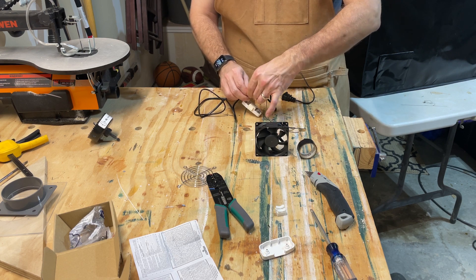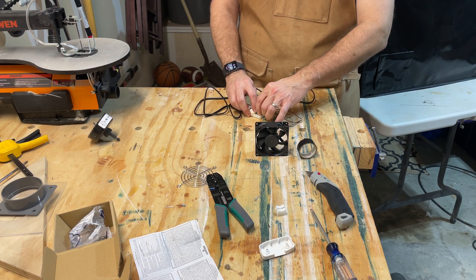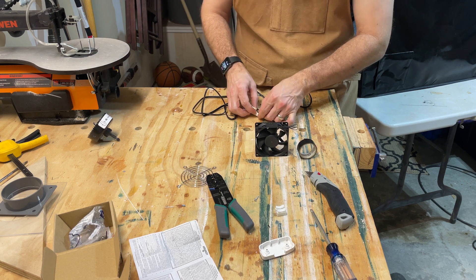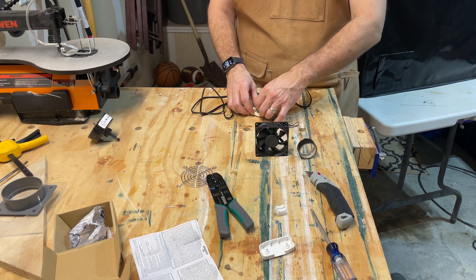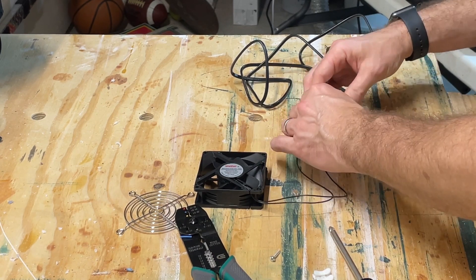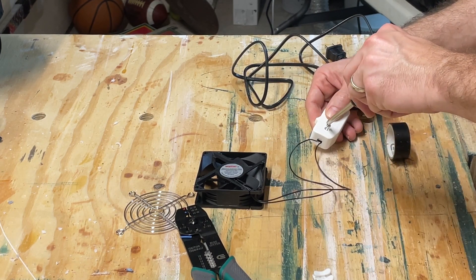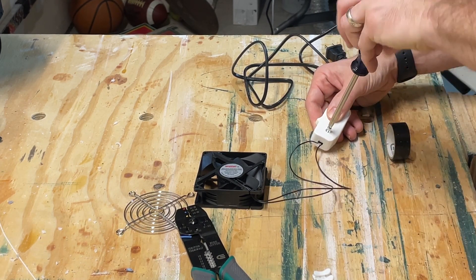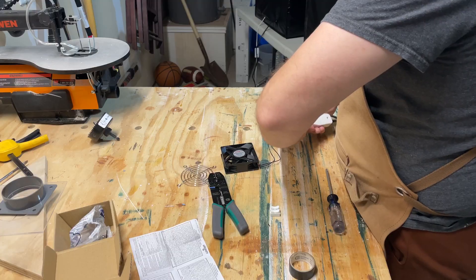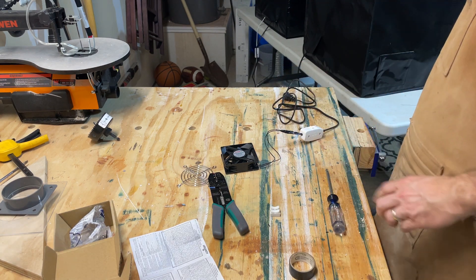Now I'm putting some electrical tape over that spliced-together section of wires. There's a slot in the enclosure that you have to kind of finagle that set of wires into, and then once I did that, I put the cover on — the switch is ready. Very simple, very easy. You just put two screws in, it holds the cover on, and it works perfectly. I also shored up those two flimsy wires going into the switch from the fan with a little bit of electrical tape.